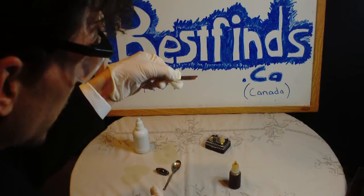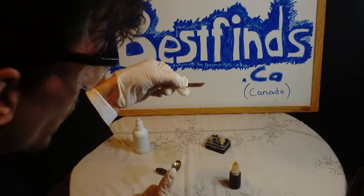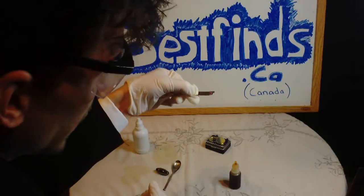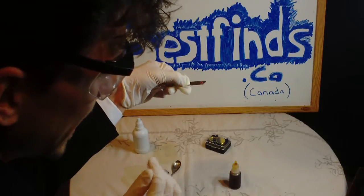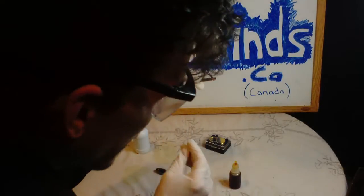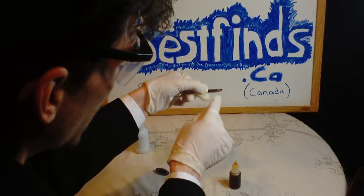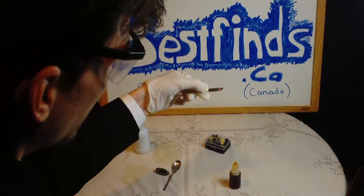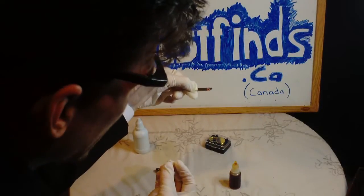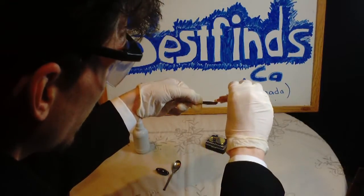And that's an indication that there's at least a coating of silver on it. And in order to find out if it is indeed fully silver, what we'd have to do is take a file and cut into it, exposing the base metal. And in that way, we'd be able to get a different color reaction. But you can see it's browning already, fading from the red. So that means it's already etched away the surface layer, and it's starting to react with the layer of metal underneath.